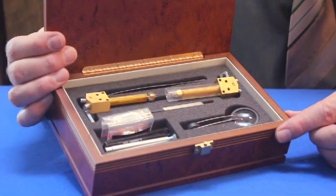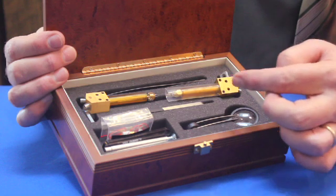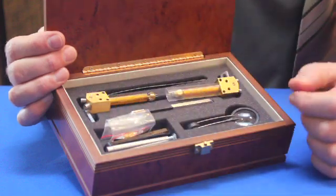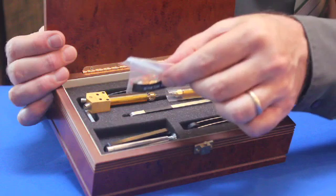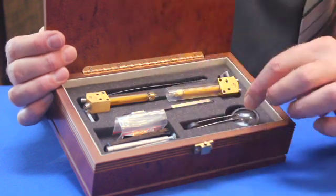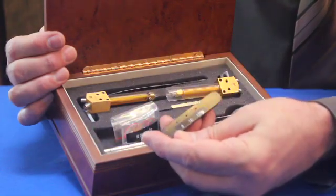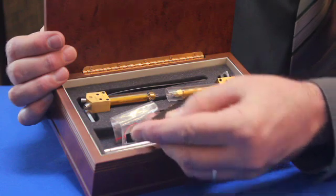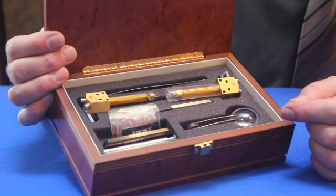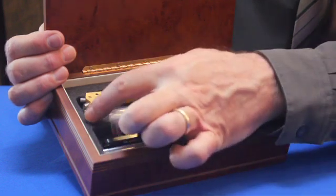Let me summarize what's in the DBT-40-1mm kit. You get two multi-mode 40 gigahertz probes, a tool for connecting cables to the probes, a 50 ohm adapter kit that wire-wraps and sets each probe to 50 ohms, tweezers and a magnifying glass for wire wrapping, a pitch-setting tool for adjustment to 0.81 and 1.27 millimeters, and with tweezers you can set it down to about 400 microns on the signal-to-signal pins. It also comes with an adapter to connect to probe manipulators using the wide angle bracket.